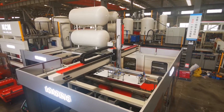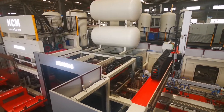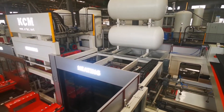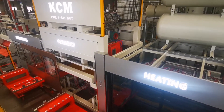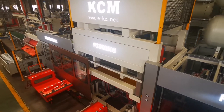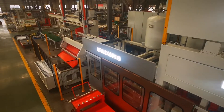KCM has the latest design for a vacuum forming box with upper and lower reduction frame for fast production rate, as well as a clamper for sheet movement for more stable sheet transferring between different stations. Forming dimensions can be designed according to customer demand.